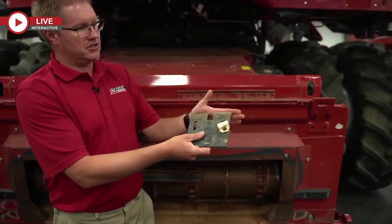One of the questions was about grease intervals on the 9250 combine. This sticker right here gives you the entire interval. It doesn't matter what model of combine — there is your grease interval sticker located at the battery box. A couple shots for the chopper bearings and the rotor bearings. Make sure you're not over-greasing because over-greasing will damage a bearing just as much as under-greasing.